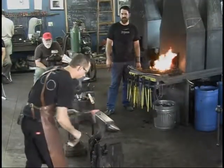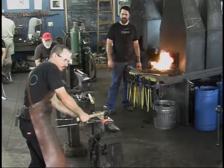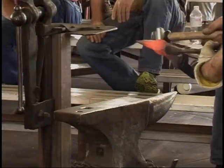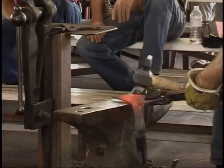Part of the reason I'm working over here, if I'm hammering that portion, is this nice soft rounded edge here is wonderful. It keeps from digging in at the base. I like to try to keep a radius to that. So working it right there over that generously rounded part of the face.